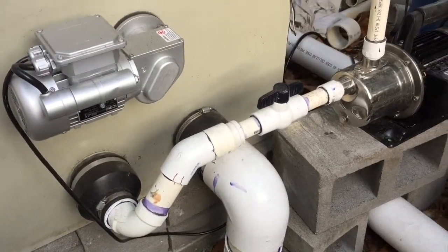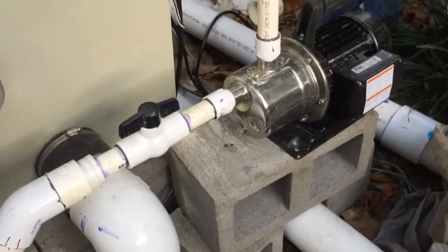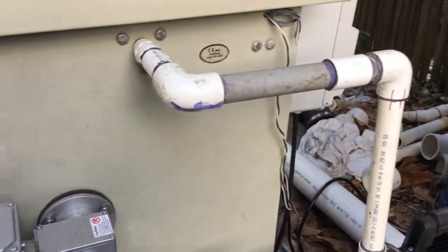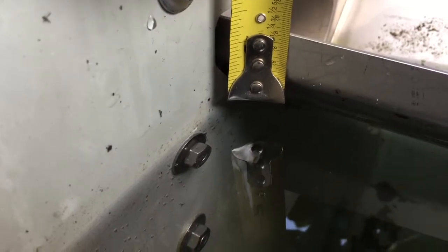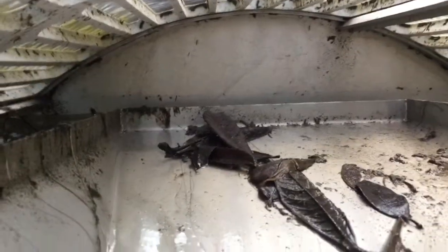This is the outlet side of the pump. As you can see, I've used one of the outlets to feed the jet pump, which in turn is used to clean the drum filter. It's important to have the correct water level inside the drum. Here it's an inch and a quarter less than the top lip of the waste tray. You want it as high as possible since you want the most surface area to be used on the drum screen. Anything higher than this will just overflow over the top lip of this tray.